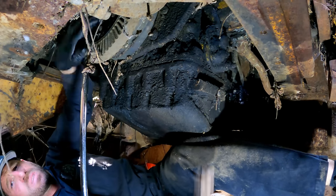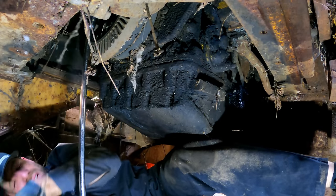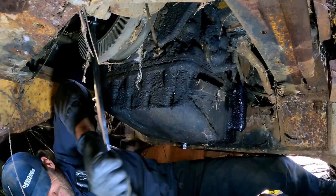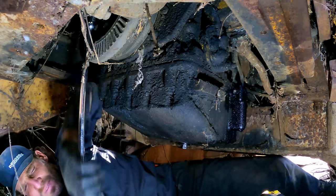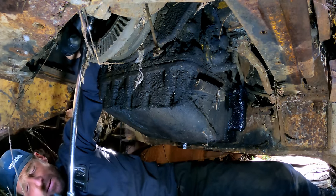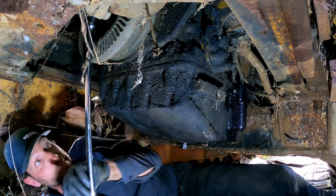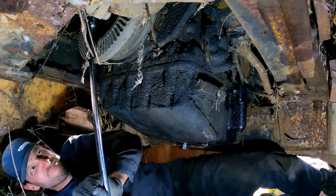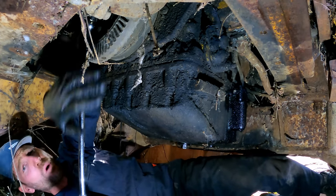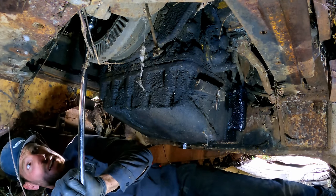Yes, this is great. I don't hear any rust in the cylinders either. I don't hear any noise. It sounds just phenomenal. Oh, all right, getting a little tight. Okay, we hit a tight spot again. So that's either water or a big rust ring in the cylinders, I'm guessing, or engine damage, who knows. Oh, see, now I just let it sit and then I was able to rotate a little bit more. That tells me definitely fluid in the cylinders because it probably weeped past the rings.